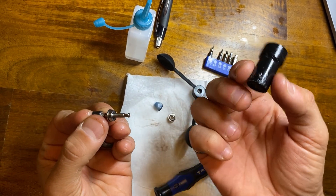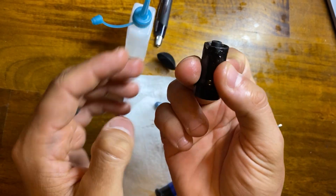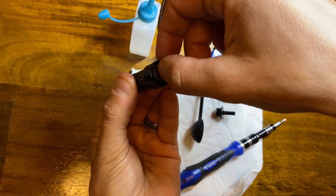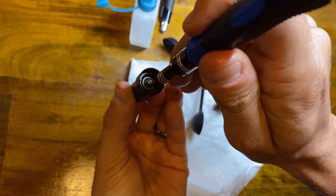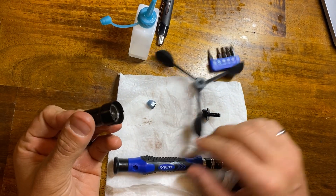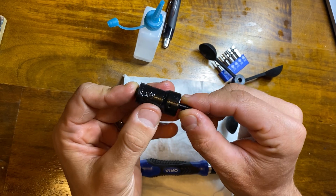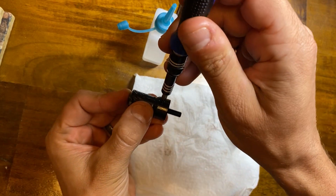To put it back together, obviously we do the opposite. Put this in this side — it's almost flush with the top. Then you insert your bearings: the small side goes in, broad side goes on the outside. Put that over top like so, you need to push down a little bit. Don't damage it, just jiggle it. Then we can take the other bottom piece, put this on here — you want it all the way in — and then you want to find your hex screw again and go ahead and tighten that up.